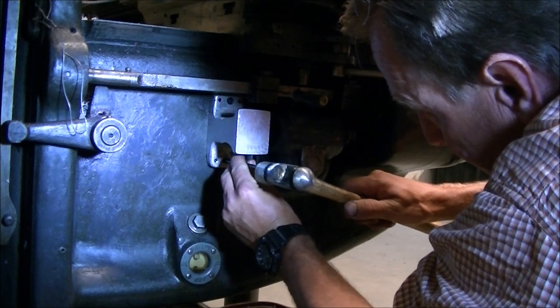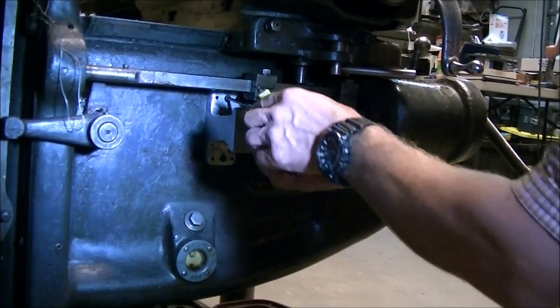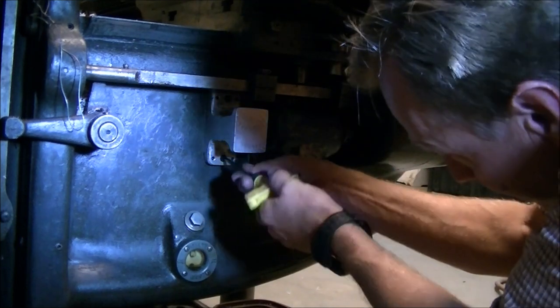So I'm just putting another hole and I had to move that little bracket that's above my hands - that's a moveable stop for the Y travel. You can set those stops and it'll kick the travel off when it reaches those.